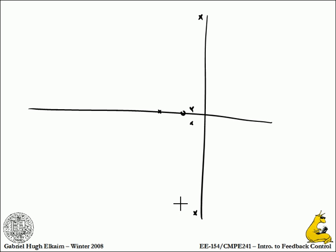What I want to do is I designed my compensator to work on this, and I have to be careful about these guys because these guys can go unstable. But the interesting thing to note, first of all, is how fast do these guys move with gain? One of the things to realize: what is my gain up here? It's going to be K.